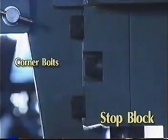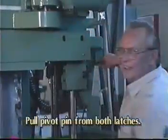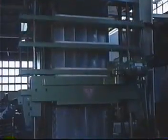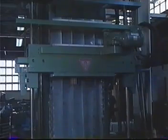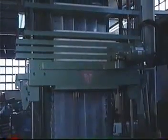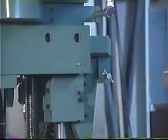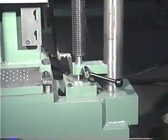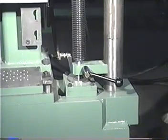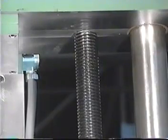Adjusting for a larger coil: loosen the four corner bolts on each stop block — again, do not loosen the center bolts. Pull the pivot pin from both latches; these pins keep the latches from disengaging when the RAM moves up. Moving the RAM up with the pins removed will pull the stop blocks with the workhead. Raise the RAM so the workhead is above the finished coil length. Lower the RAM until the distance from the top of the nest block to the bottom of the stripper equals the expanded coil length from end sheet to end sheet. Tighten the stop blocks and reinstall the pins. Loosen the air cushion clamp and, with the workhead resting on the stop block, lower the screws until they are approximately one inch above the air cushion clamp. Lower the RAM until it bottoms out, then raise the screws until they touch the top of the RAM and the drive clutch slips.